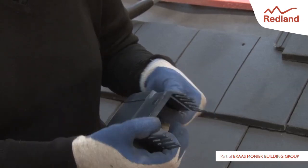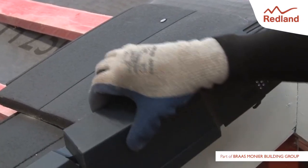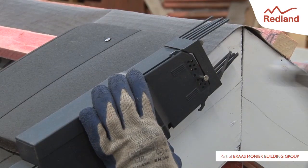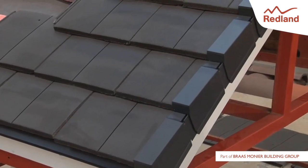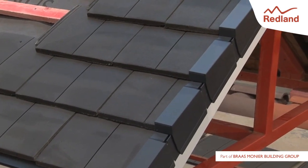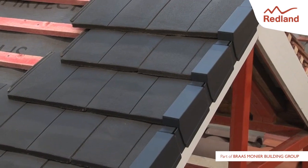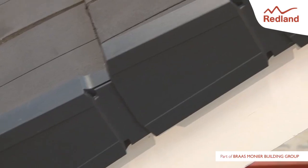Before clipping onto the top two ambi-dry verge units, add the ridge comb to the verge unit and mesh together, thus preventing bird access. Install the tiles into the verge units using the appropriate tile type where necessary. Complete the system at the ridge verge junction with a block end ridge tile or ridge end cap.